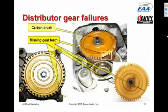And it seems like pilots have this notion that the only kind of mag failure is one where the mag just stops working and stops firing. But that's not true. The most common cause of mag failure that we've been seeing are distributor gear problems like this, where the mag keeps firing, it just fires the wrong plugs at the wrong time and causes the engine to do really horrible things. And the resolution to that is to figure out which mag is bad and turn it off. But for some reason, most pilots just don't seem to have the presence of mind or the presence of checklist or whatever to do that. So that's the reason I'm making a point of this.